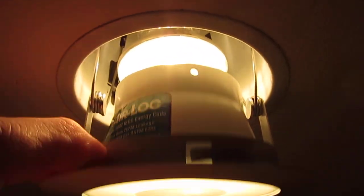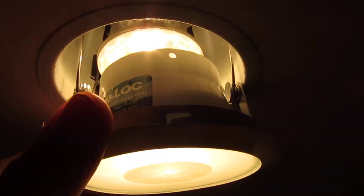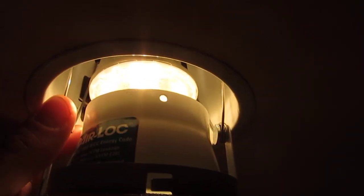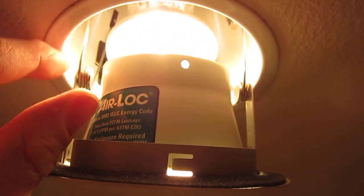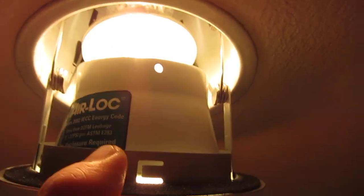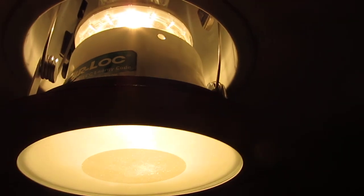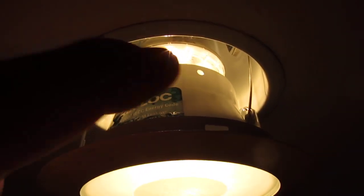Now there's an additional step that you need to do. You won't really be able to remove the bulb — there's not enough play to get that to work, I've tried it several times. What you actually need to do is pull the ends of the spring on all four and unhook the hooks that hook into the actual fixture. Then you'll be able to replace the light bulb. I'm not going to do that here because it's actually quite tough to get these things back into the slats once you take them out. But once you do that it's actually an easy affair to replace the bulb.